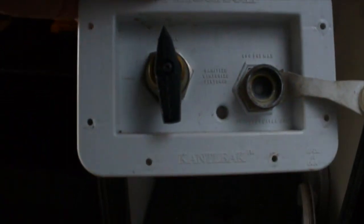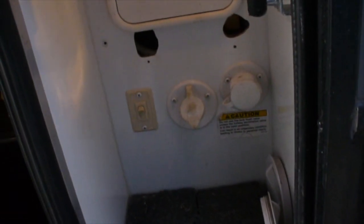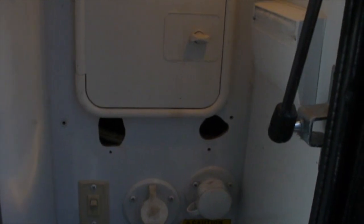For the Anderson valve, I used the outside of the old 4-way valve, and you can see where my Sharpie made marks on it. And that made a perfect template for the width, and then I had to move it down another inch from there to get the right size for the new valve. And then from the bottom of the new valve cover plate, I moved the faucet down, and I had to cut a little bit more than an inch out to do that.